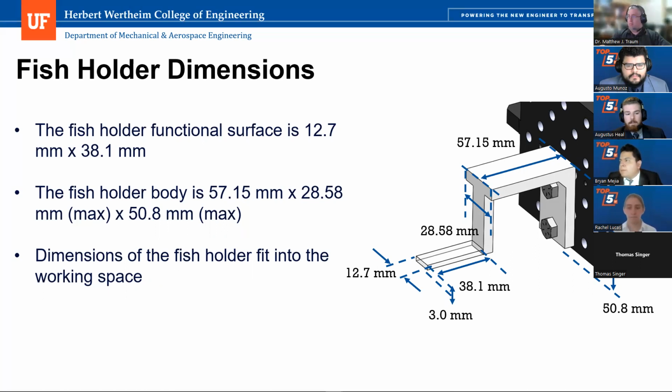I'm looking at that chamfer that you've got in there. I like that you have a chamfer because again, structures guy, I don't like to see sharp corners, and I kind of suspect you might have one over on the other side. But you've got a chamfer here, and I appreciate that. But I think you might wind up having a clash between the chamfer and the head of the bolt, or at least difficulty accessing with a tool.